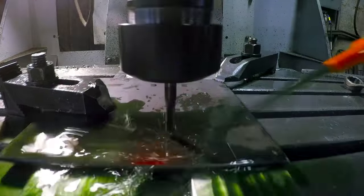Now when I do the actual bevel grinding, you're gonna see that I'm doing something kind of unique. I'm not gonna just do straight up and down passes. I'm gonna be going at 45 degree angles, both left and right. And the reason for that is I wanna try to get these bevels as perfectly flat as possible. And when you change your angles up when you're grinding, you're getting all the little dips and grooves sanded completely out, and then we move on to the actual polishing.